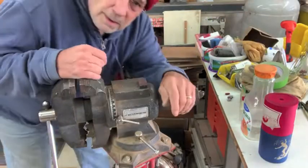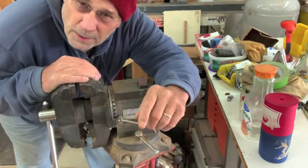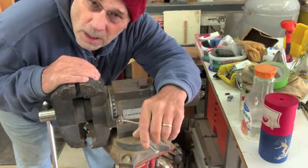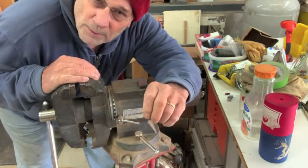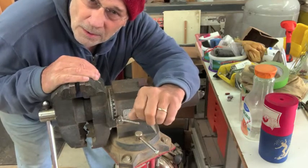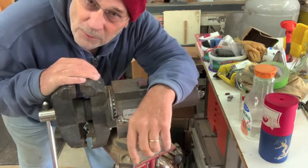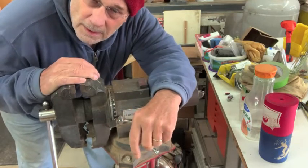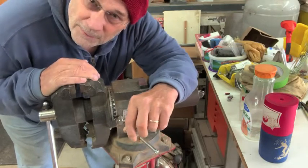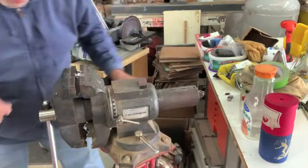Okay, now, here at the vise is where my BHN testing starts. I'll take a cast from one of the casts that I've made. You know, end up with a whole pile of them. I'll just take one at random, preferably one that I don't like. And it comes here to the vise, and then I'm gonna have to file a flat on the side of it. Okay, so here's what happens.